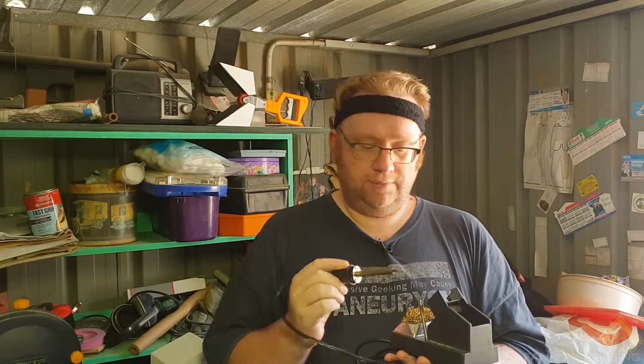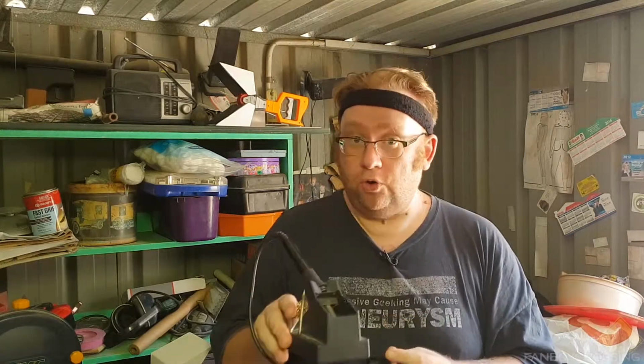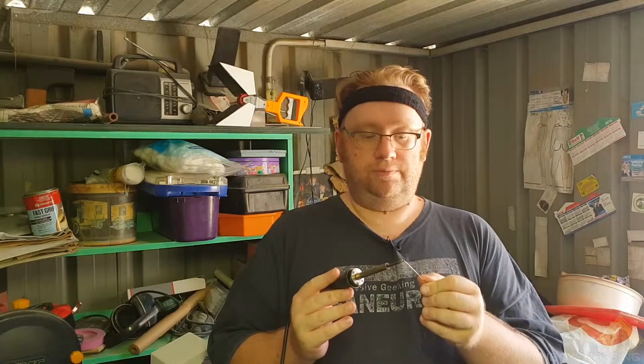They give you plenty of time to work as you're going. So yeah, clean your tip before you work, not afterwards, and you'd be surprised. I cannot stress enough, never ever touch the metal bit while it's plugged in. If you want to test if your soldering iron is at temperature, then grab a bit of solder and just touch it to it, because if it's hot enough, it will melt. It will pretty much just melt immediately.